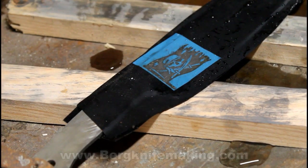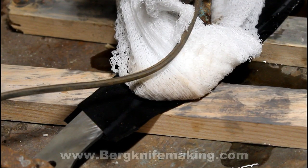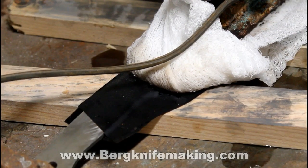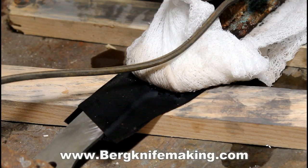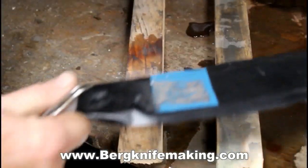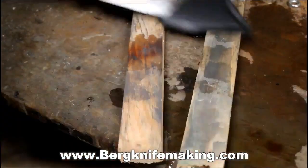I etch for a total of about three to four minutes, depending on how deep I want the etch to be. Usually three to four minutes will suffice — it gives a nice deep etch that you can actually catch your fingernail on. To reiterate: I only etch for about 20 seconds at a time, doing three batches of 20 seconds, cooling in water every minute. After a total of three or four minutes I can check the depth with a tweezer in a corner of the workpiece.